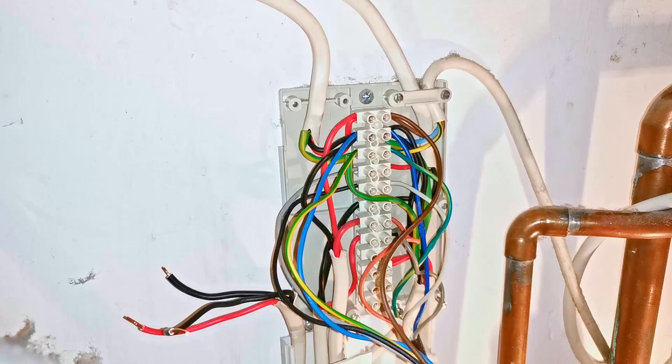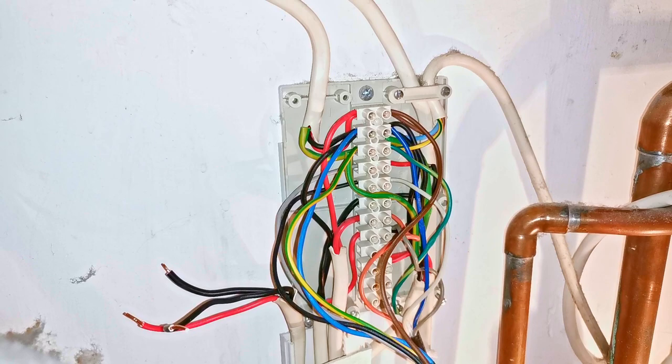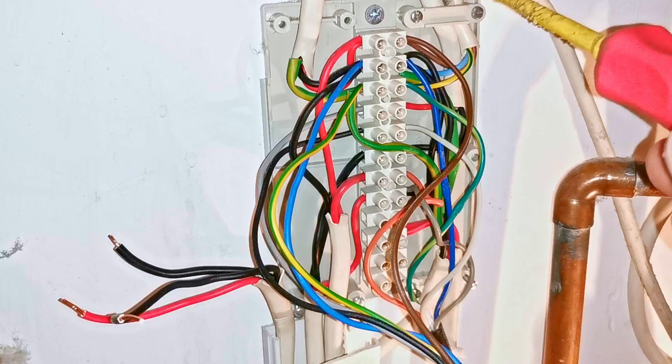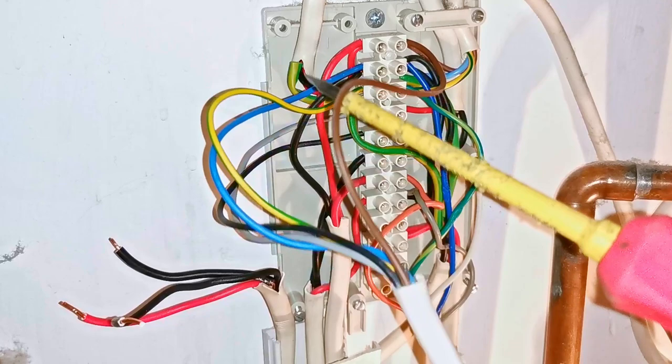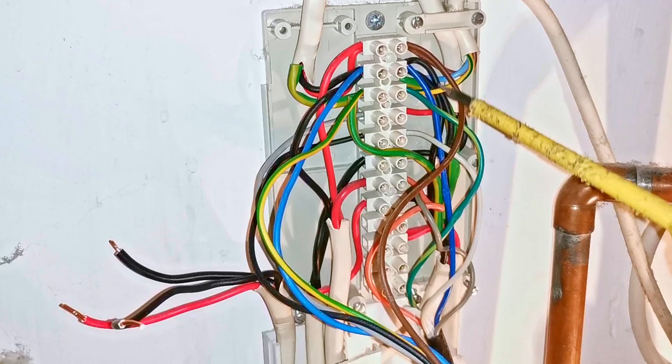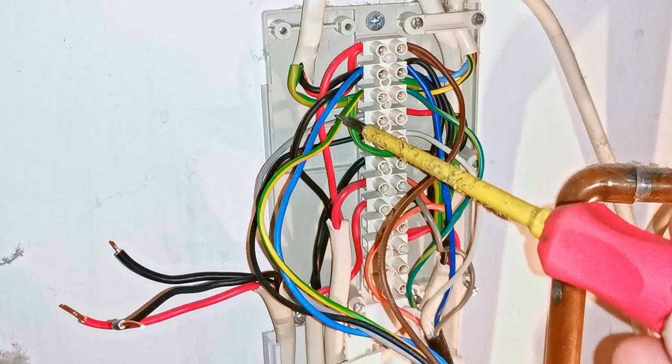Because I was working in such a tight space I was unable to film myself connecting all the wires. I've now removed the room thermostat and connected the new receiver unit. Here's the live, neutral and earth coming in — I've connected the brown permanent live to the receiver unit's brown permanent live wire. So the receiver box will always have permanent power to it. I then connected the neutral wire — the blue one — to the receiver box, and also connected the earth wire so the flex is protected.